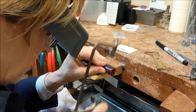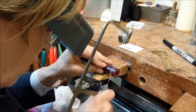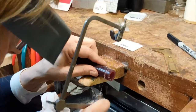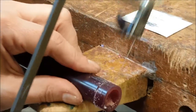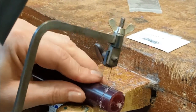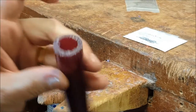This is easier for me. And the interesting thing about a wax blade is that it's twisted, so it's cutting in both directions — it's cutting when you push down and when you pull back. So it's really important to go around and around and not just cut from one side through to the other. That way you can stay on your line better.